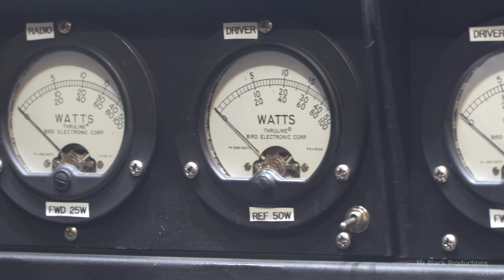Okay, so we're outside now, and that's the Leece-Neville 320, 325 amp, whatever it is, alternator that we just installed in the stock location. And we pulled the Delco Remy that was in there, a pile of junk. What was it, 160? 165. Yeah, 165. So when he's got all his lights on, his inverter running and everything else, it's pulling continuous, like 80 amps. Well, that leaves like 40 amps literally left over for him to run his radio stuff.